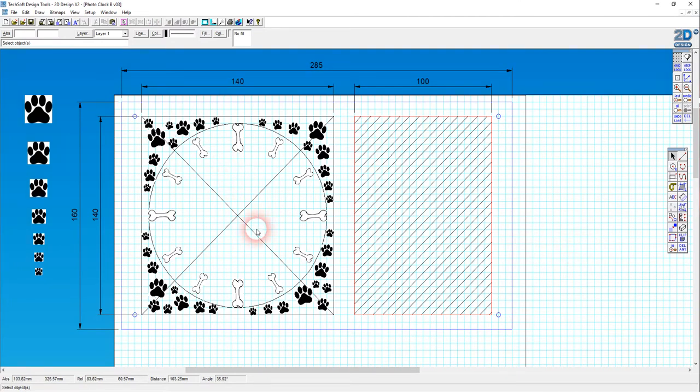For completeness I will re-enter them over here - I want my engineering drawing to be complete. The problem with this diameter dimension line is that it will partly engrave the 130 and the arrowhead will be laser engraved. So in this particular case I'm going to have to delete that, which I don't like doing because I like the dimension lines being in place, but I can always bring it back later. I'm going to pause the video here and go ahead and laser cut and engrave this as a card prototype.